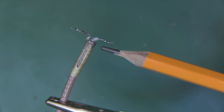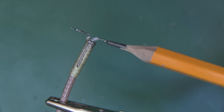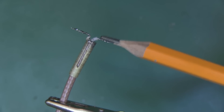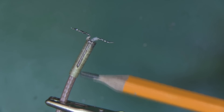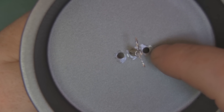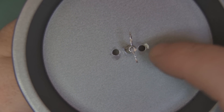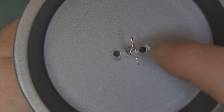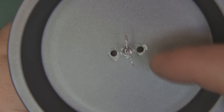Here's a close-up of the completed soldering: the outer braid is soldered onto the balun making contact with the tube, and the signal wire and remaining outer braid are formed into a T-shape for soldering the elements. Before soldering the balun onto the reflector, make sure the T-shape for your driven elements is opposite the two holes for the parasitic element supports — otherwise the driven elements will be in the way of the standoffs.